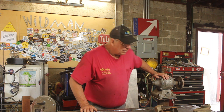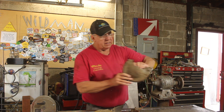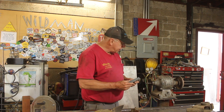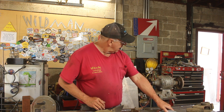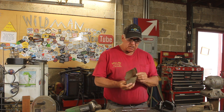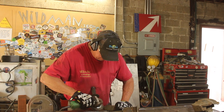Well friends, for better or worse, this thing here is my bench grinder and it needs some work. It fell over and the cast-iron shroud broke into three pieces. The one it came with was already missing a piece, so I think we'll just toss that. The plan is to fix this first, and then on the other side we'll build a belt grinder attachment. The repair job is pretty straightforward — we'll clean this up, braze it back together, and make a brand new outer cover.